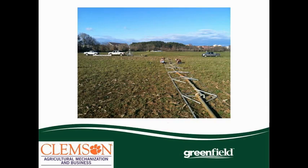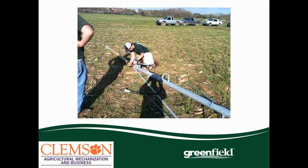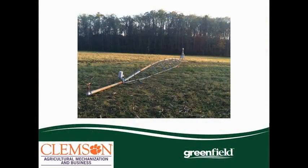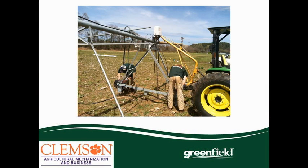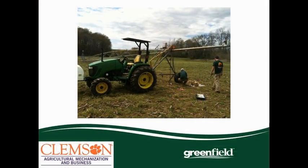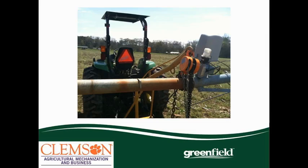This shows how we had the pivot laid out on the ground before we put it together and stood it up, to make sure all our components were together with the right truss rods and bars. This is showing us picking up all the truss rods. Just more of us putting the span together — we put it all together on the ground and then stood it up afterwards, putting every bolt in. That's the span laying on the ground before we stood it up. Next, we picked up the end tower and put it up with the wheels attached, picking it up with the tractor.